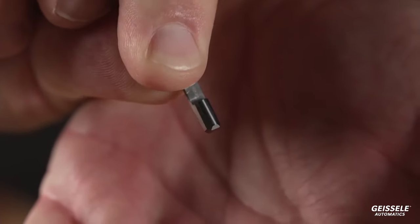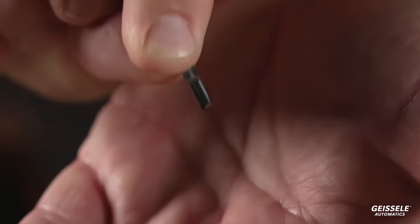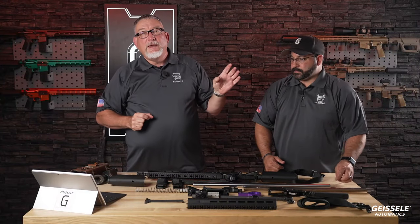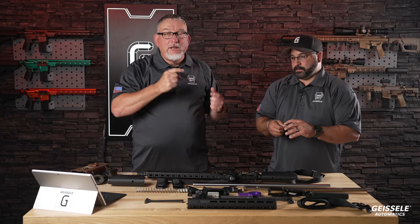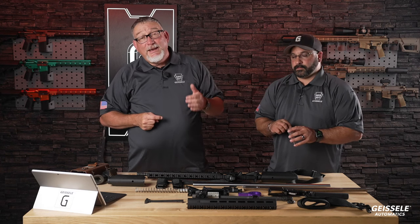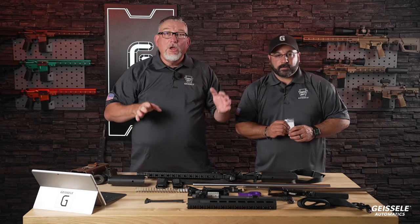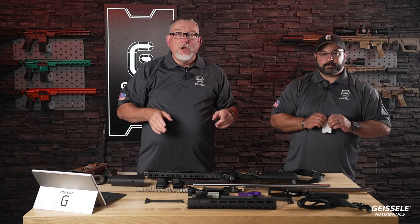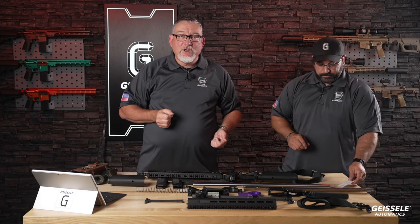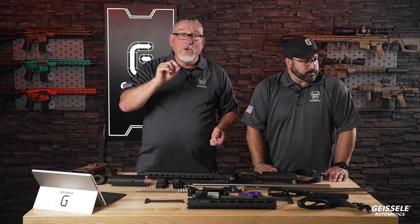There it is. I actually don't want to show the end of it because it's very proprietary how we do this, but this little cutter right here shaves 1/10,000th of an inch off of the rifling in a pass. Then it indexes to the next one and shaves 1/10,000th of an inch off, and then the next one. It takes approximately 40 minutes to cut rifle a barrel, but you can get the barrel exactly on size. Shortly before we reach size, the barrel technician checks the size of where the cut rifle is cut to, and then he adjusts it to bring it exactly on size.